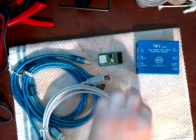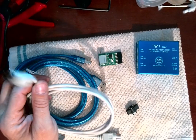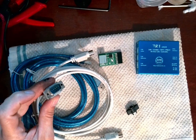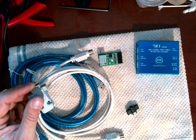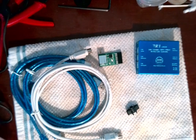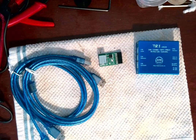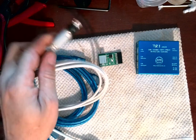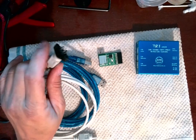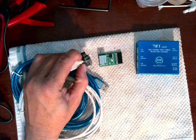There are a couple of ways you can do this. You can either use the cable that came with the unit, cut a plug off, and then get a solder-type DB9 to plug into the RT97S — that's one way of doing it. Or you can get one of these chassis mount DB9 connectors, plug this in like that, and then solder your wires to the socket. You don't have to ruin the cable that way. You could put this in a little box. So those are a couple of different ways of hooking this up to your radio.